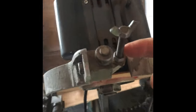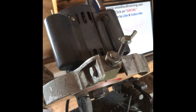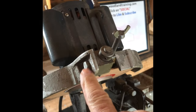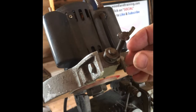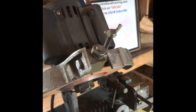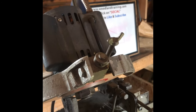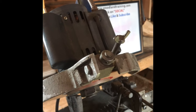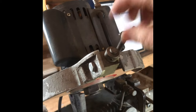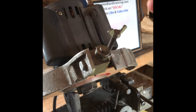One of the dressers here is doing the side plate of the tooth; the other one's doing the top plate. How these are adjusted: we loosen that bolt and that whole little unit will tip. You'll do a little experimenting if you're setting up a grinder for the first time, to get that side plate angle and top plate angle where you want it. Once it's set, that's tightened up and it really doesn't change.